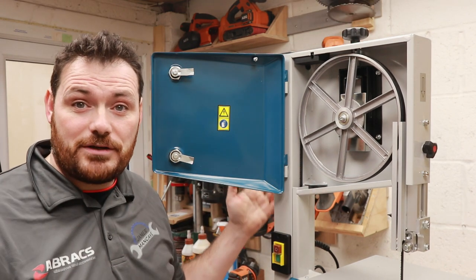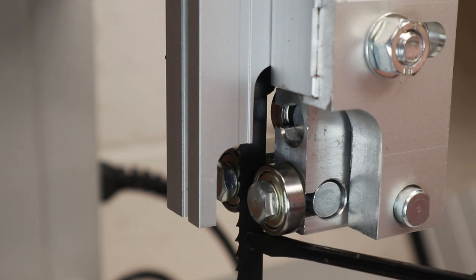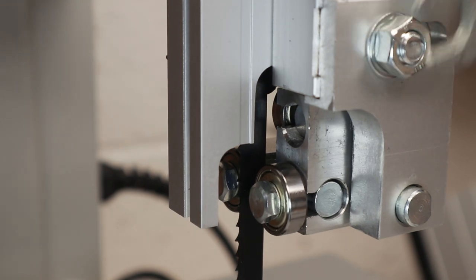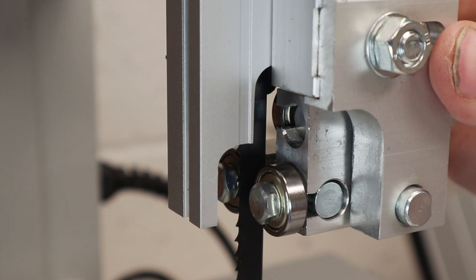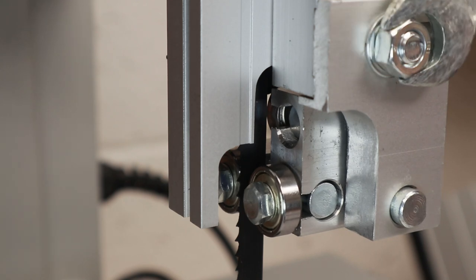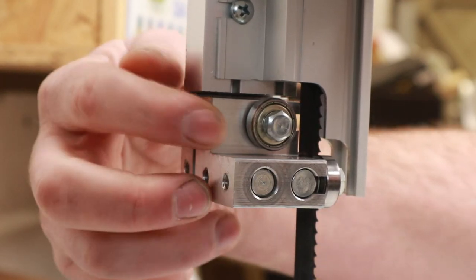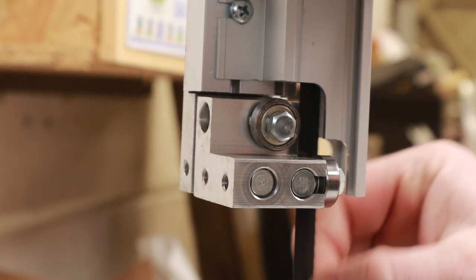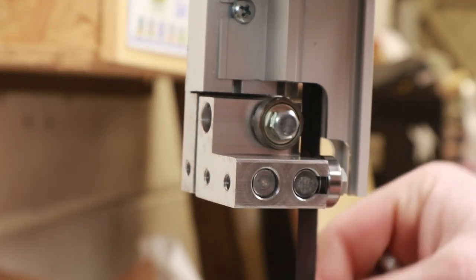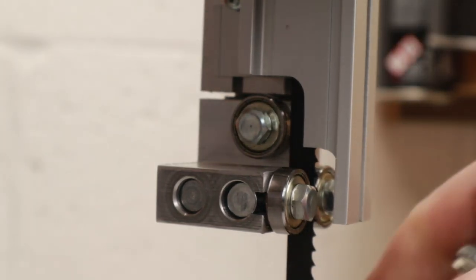That's about right. So now you need to check the tracking hasn't been thrown out. The next adjustment is on these side guides - we want to adjust the front and back movement of them so that they sit just behind the deepest part of the gullet of the blade. If they sit too far forward and rub on the teeth of the blade then it will eventually flatten the teeth, throwing off your cut. Mine unlocks with this bolt and I need to slide them forward a little bit. Now we can adjust the thrust bearing on the back - it needs to be as close as possible when the blade rotates without touching it. If it's set too far forward it's going to rub on the blade and cause the blade to drift. I've got it set now so that it takes a little bit of pressure on the blade to get the thrust bearing to rub and rotate with it.